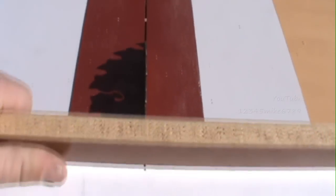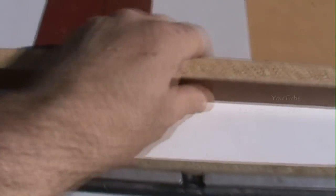Okay, as you can see, got that cut. This is going to be a nice support, and it's still a 1.25 inch blade. And look at that little blip right there. If you're cutting and your finger's there and you go too far, sometimes if you're cutting and not paying attention, or some people aren't, at least I do. So I'm going to take another piece of wood and secure that here, so no matter what, my finger won't get cut.